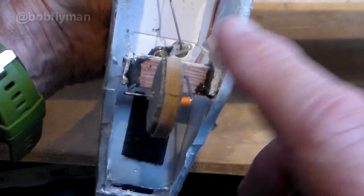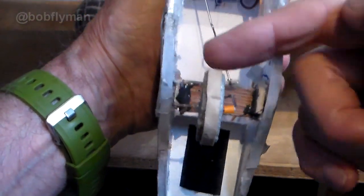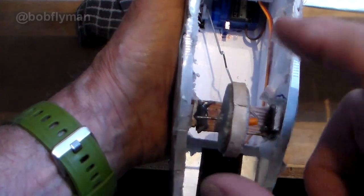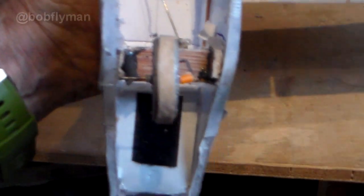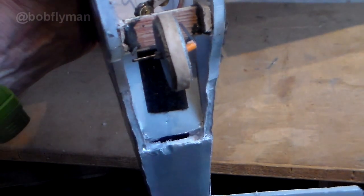I can shorten the link using these v-bends so that the wheel is properly fore and aft when the rudder is fore and aft. It's taken a fair bit of messing around - if I'd thought of it when making this part I should have made that lever offset in the first place. But with a bit of bending and tweaking I've got the lever sitting at the right angle of thrust for the rudder servo. When I finally glue this in I can set it up in exactly the right position.